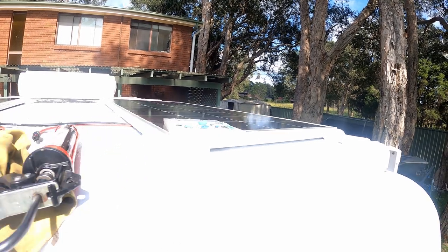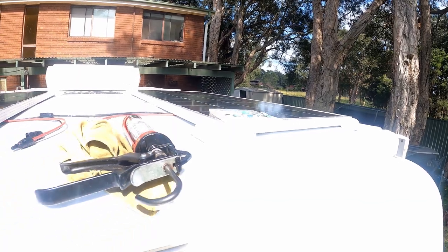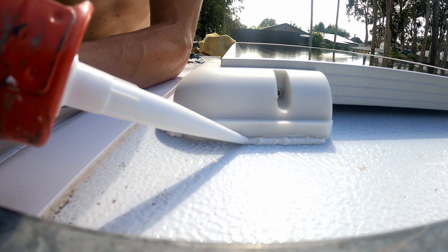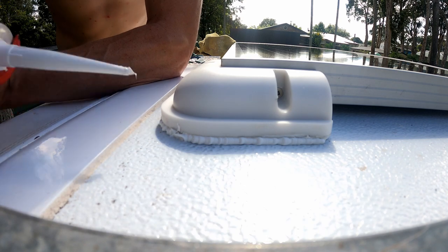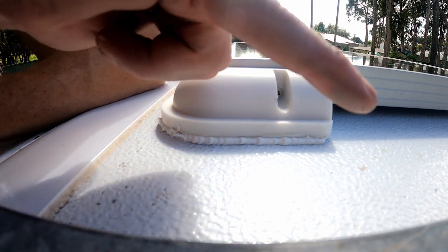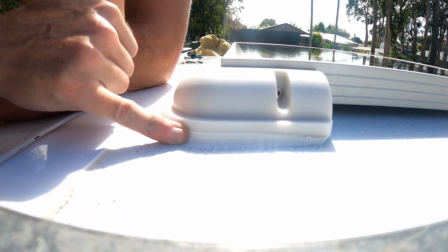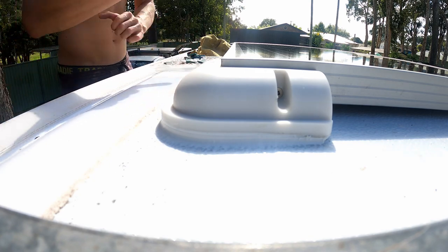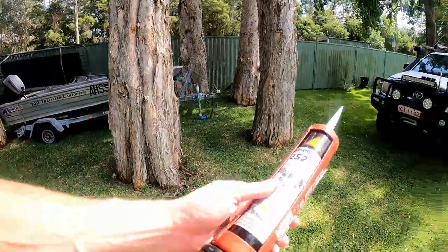It's been about 15 minutes. I'm just taking out the little packers and letting it settle. Before that I finished up these ones just with a small bead to fill in the gaps on the outside to make it look nice and professional and stop any water getting in there as well. You can get a tool for this — I'll just use my little finger, it's about the right size and you can put different amounts of pressure on. One tube was just enough.